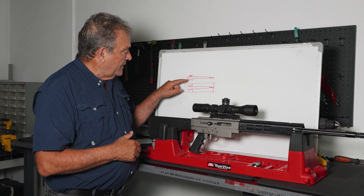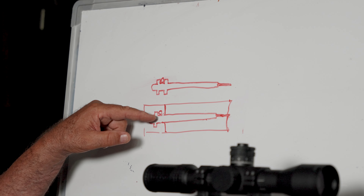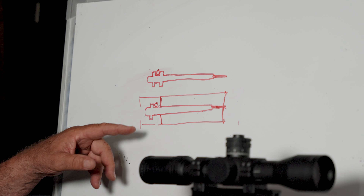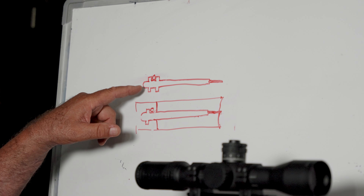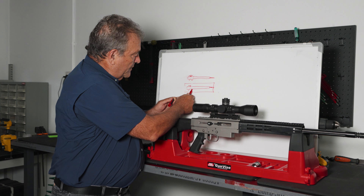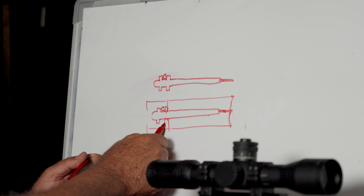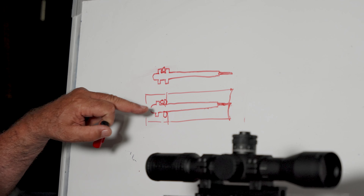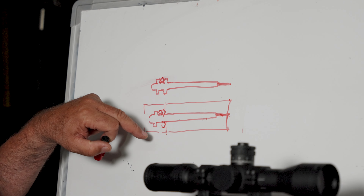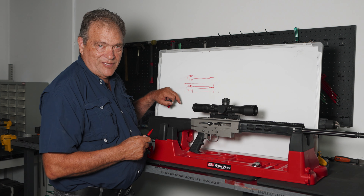What we've done now is make the front and rear lugs with the same travel, made the front one the same thickness, because we were working with a firing pin from another rifle and it just wasn't good enough. We've now made a new one and shortened the bolt carrier to take into account the thicker lugs, so that the travel remains the same. That probably tells the story of why we didn't show you ADI — I think we fired two rounds and that was it. We will bring that to you another day.